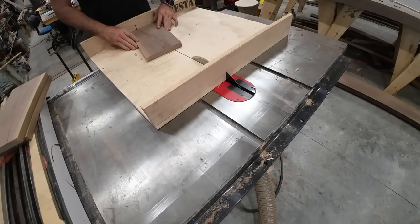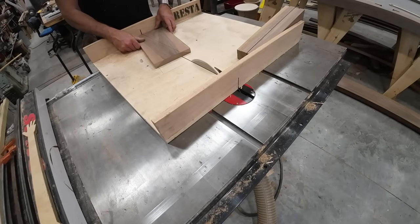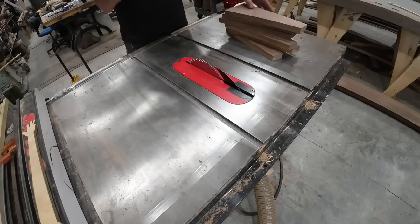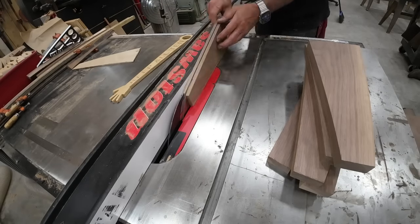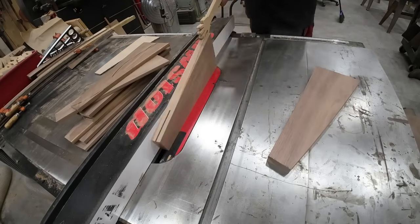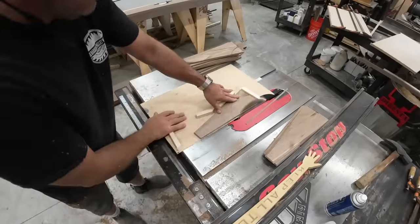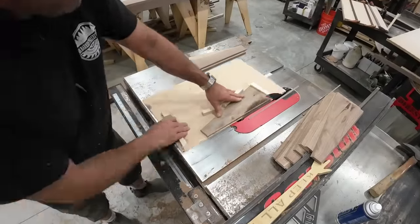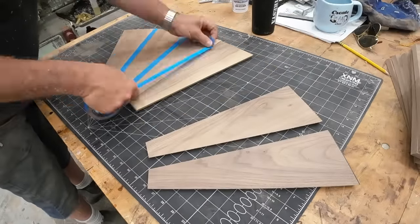Now I'm on to making the legs. I came up with this design that utilized six sides of a tapered leg. I'm maximizing the amount of material by using this 7/8-inch material — I'm splitting them down to about three-eighths of an inch. I made a jig where I'm able to bevel each one of the sides on the table saw — I cut one side, flip it to the other side of the jig and cut the other side, putting a 30- or 15-degree angle on there.